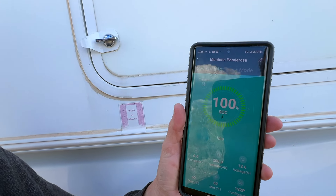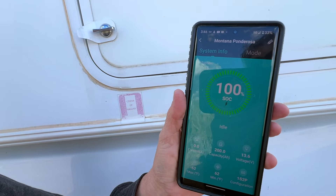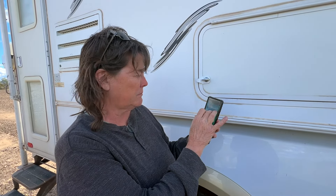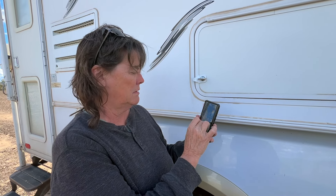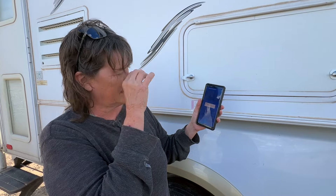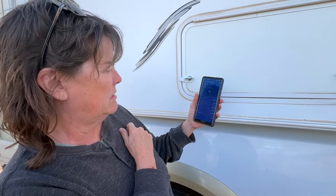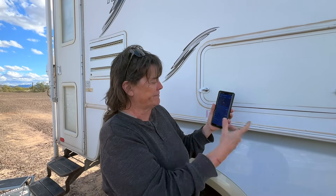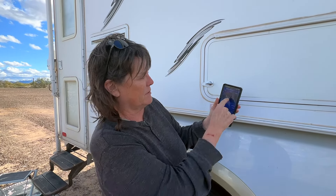It's not receiving any power from the sun because it's at 100%. That's cumulative — both batteries together. I can go to mode and that shows both of my batteries. I also got a Victron charge controller. Right now at 3:47 PM it shows I'm floating, meaning my batteries are 100% and the solar panels are just idle, with the charge controller turning them off so they don't take in power. And I guess I'm using 23 watts.